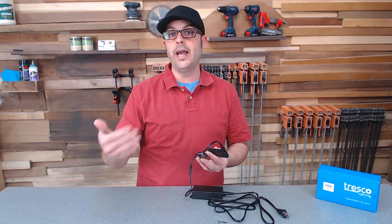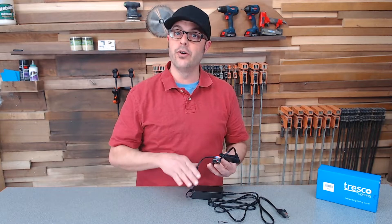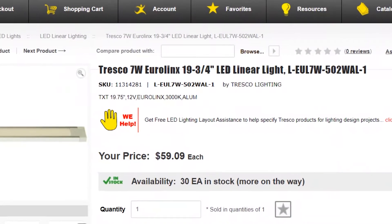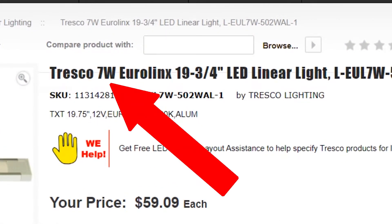This all depends on your wattage — how many add-ons you can connect and how many lights you can run per transformer. With a 60-watt transformer, if you had three-watt lights, you can run 20 of them. To figure out what size transformer you need, just find the wattage listed on each of the Tresco lights, add those up, and get a transformer that's just a little bigger than what you need.